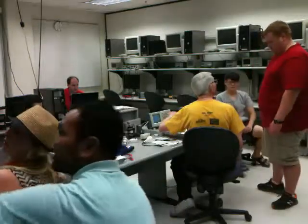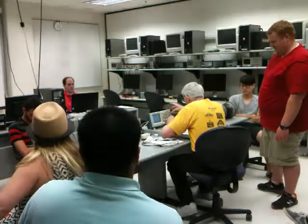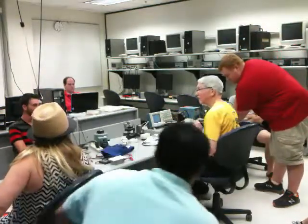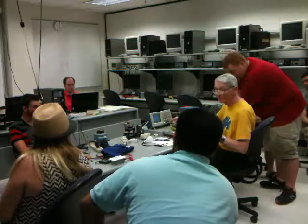This is measuring the voltage across a small resistor. The resistor is connected on the ground side of the power line. By observing the voltage across the known resistance, we can see the wave shape of the current. If I'm going to verify the current waveform relative to the voltage waveform, I need a reference. I'm using the AC power line as my reference, so the reference is power line voltage. And we're going to observe the wave shape of the current.